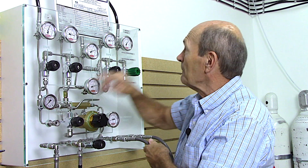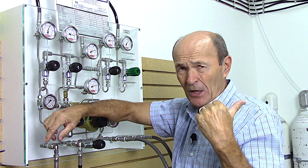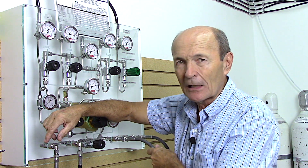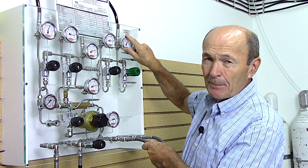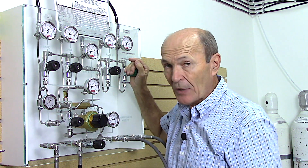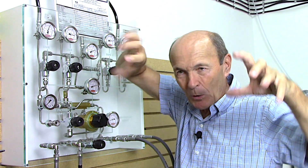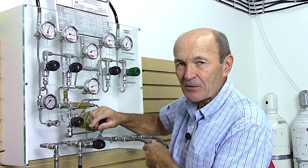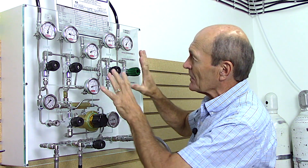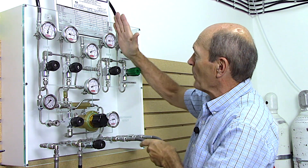So that's bank one, bank two, bank three, and compressor - that's four. What's the fifth? The fifth one is nitrox. We store nitrox in banks here and also produce nitrox right here. It has to be completely separate - that hose never goes near the air, and air never goes into that. So the last line is nitrox at 4500 psi. There's a green knob to identify it. So: five lines - three banks from storage, one from the compressor, and one for nitrox.